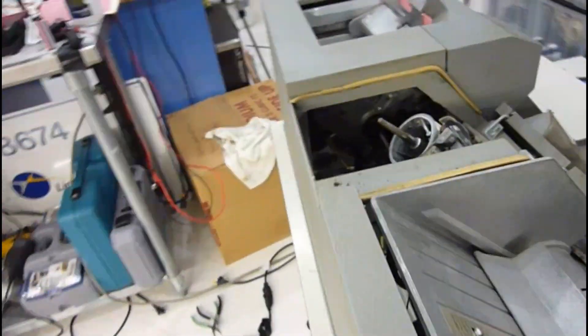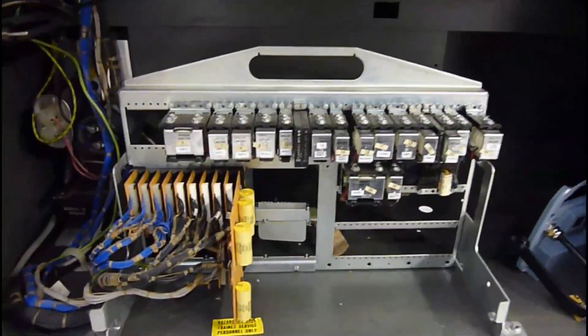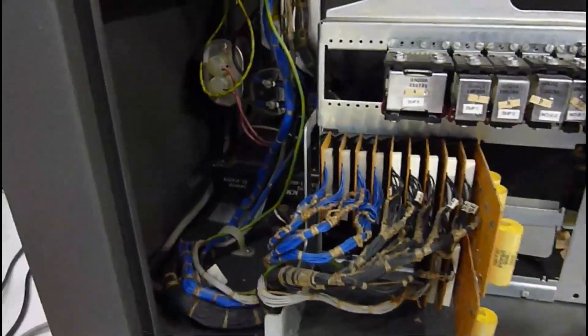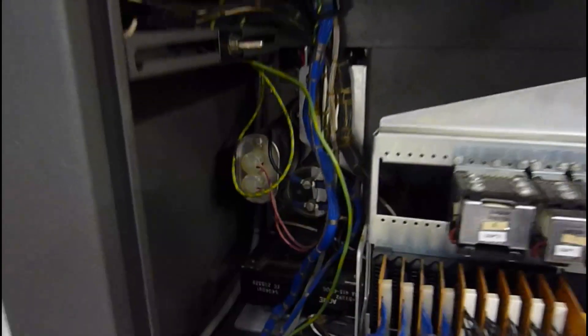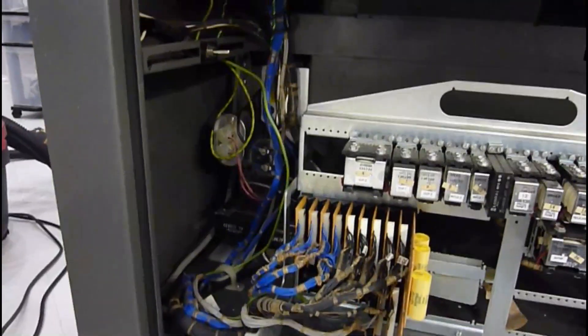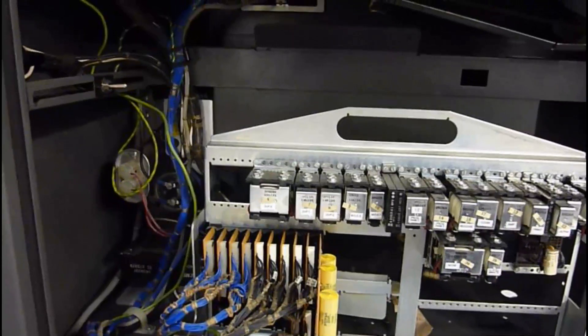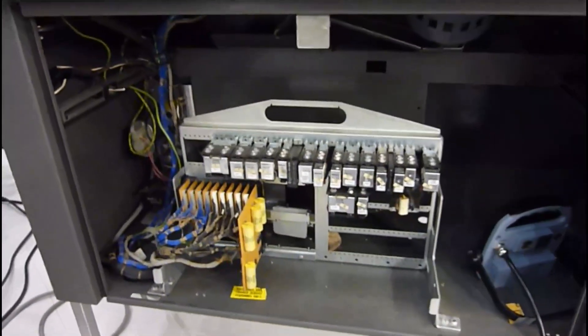No tubes at the back — it's much cleaner than the 026. It's more modern, using just relays and some of the SMS cards that you find in the IBM 1401. It has an isolated power supply at 48 volts, so that's going to be much easier to work with if we retrofit it with automation, compared to the tube-based 100-volt 026.